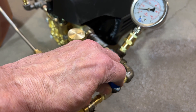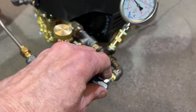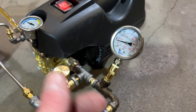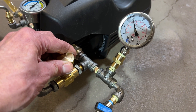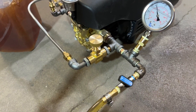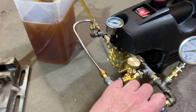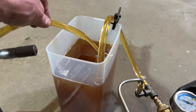But if we only need a very small amount — let's say we only need that much flow but we wanted it at a higher pressure, let's say we want 500 PSI at that flow. We're now running at 500 PSI. I've got to admit, I have not let this Loctite sit for 24 hours, so I might be doing myself an injustice. I'm going to close the bypass all the way so we can get a look at the total flow of this pump.